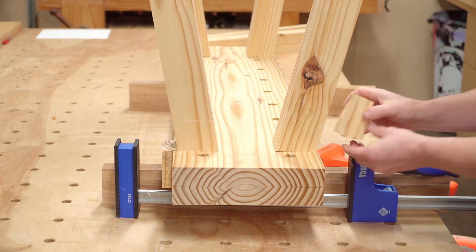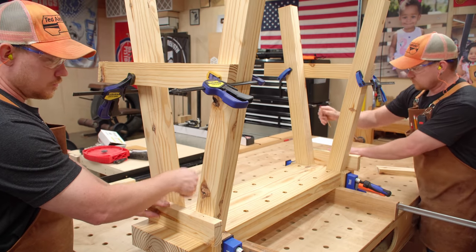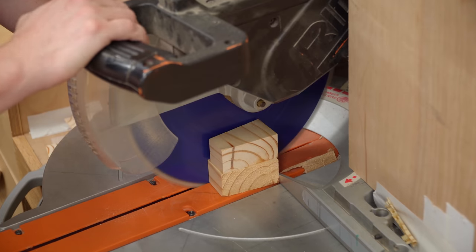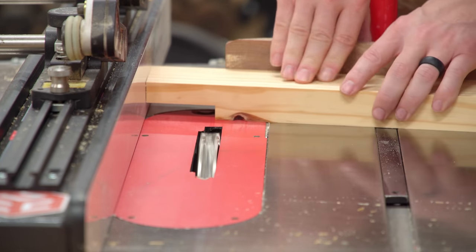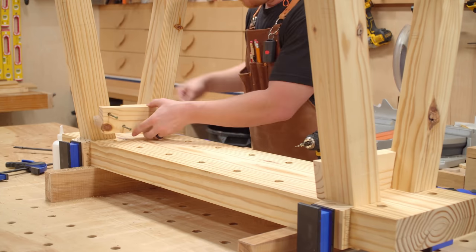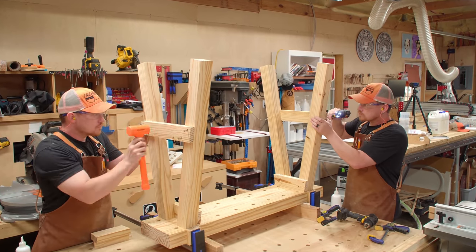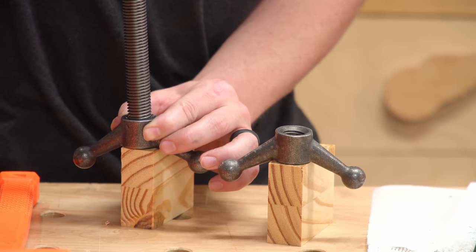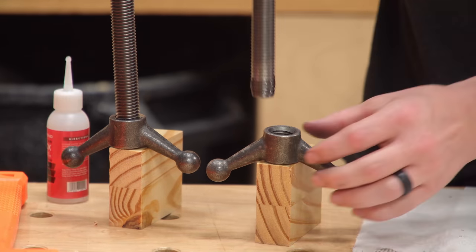The off cuts from the bandsaw are perfect to use as clamping cauls to make sure the legs are positioned tightly where they need to be. Then the stretchers can be set in place and traced with a pencil. All of these stretchers are first cut to length at the miter saw and then a matching angled rabbet cut is made on each end. To install them, a little glue and two screws per joint is used. The threaded rod needs to be secured to each one of the handles, and for that I used thick CA glue — a better option would have been medium thread locker but my shop ate it somehow.